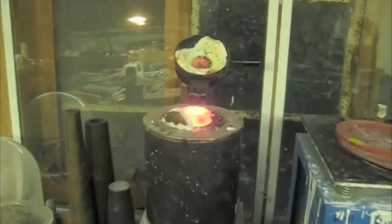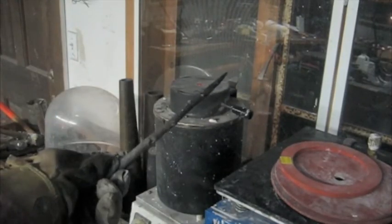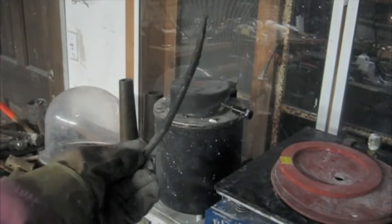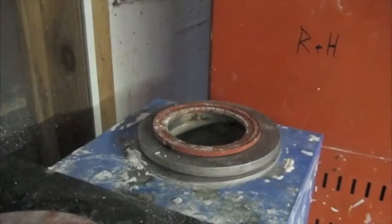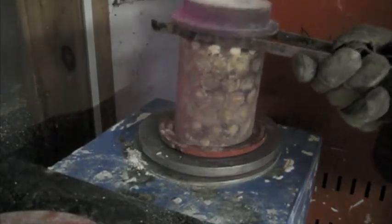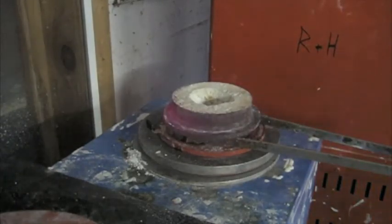About 400 grams. We're going to degas it with the dry stick method — chopsticks are perfect, they're kiln dried. What it means is the combustion forces out all the trapped gas like CO2 and nitrogen. The casting flask is about 1100 degrees. Place it in the well, turn on the vacuum.